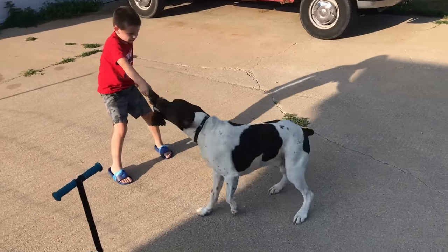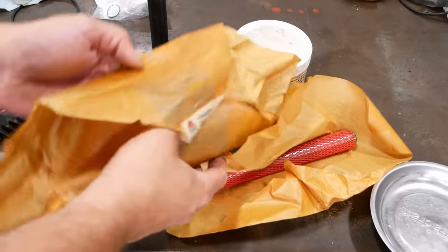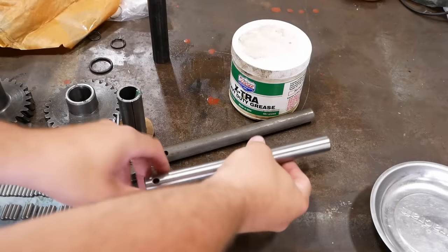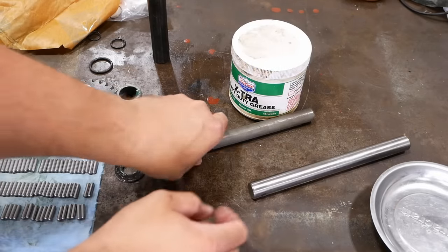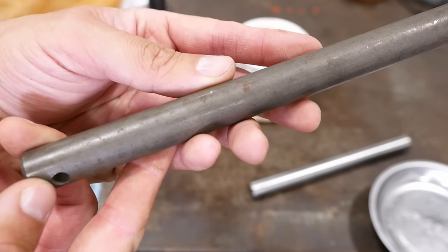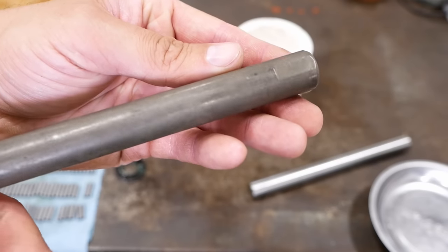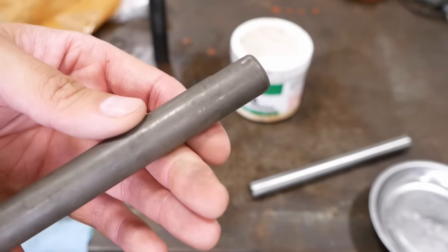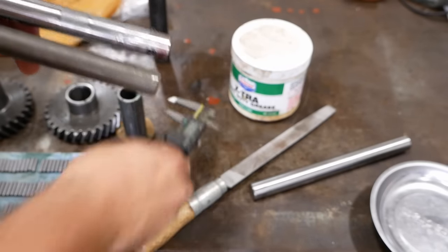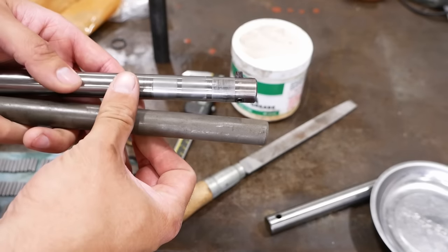Come on pup. A couple days later, we have two new shafts right from the AGCO dealership. This one looks pretty nice. This one here I am not too impressed with — what the heck is this? This is just a cold finished bar; you can still see the chuck jaws from the lathe in the surface. They made no attempt to grind it or finish it in any way. Maybe it's good enough — doesn't seem very good to me. Yeah, it's probably close enough. It's nice and hard. I guess we're going to go with it.